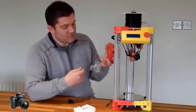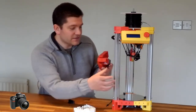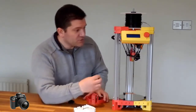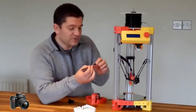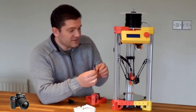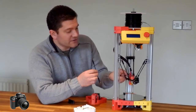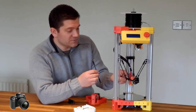It's driven by Spectraline which is really nice on the carriages here, so it's very lightweight, very fast, and very easy to assemble and set up. The push rods are partly 3D printed — the ends are printed — using 3mm carbon fibre rods, but I try to get as much 3D printing in there as possible. There are some springs just to take out backlash, and a small carriage very similar to the Rostock carriage but much smaller.